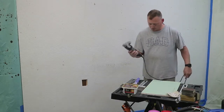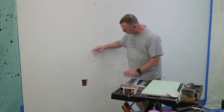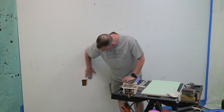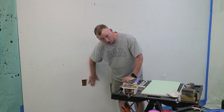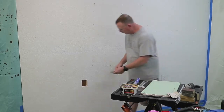I'm going to use this multi-tool with a sanding disc on it because I'm going to be changing the texture on this wall. To kind of minimize the work I'm going to take this down - the texture is here - so when it's skim-coated there will be less sanding required on the end product. Let's go ahead and start by measuring our hole and marking it out.